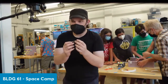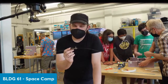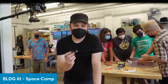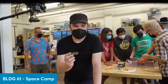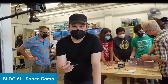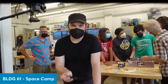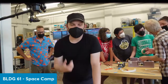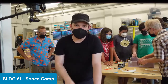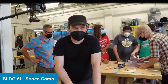This little transmitter is going to be collecting data in the air — altitude, temperature, speed, and GPS coordinates. It transmits them to various stations owned by ham radio users around the country, and that's essentially sent along to a website called APRS.fi. That's going to show us a map of what's going on locally.